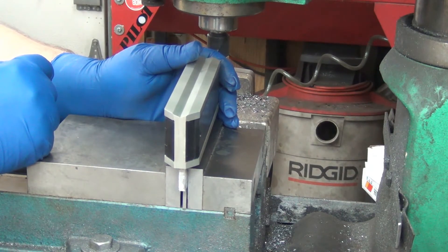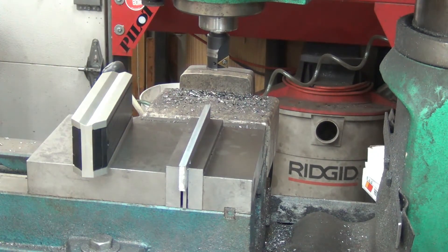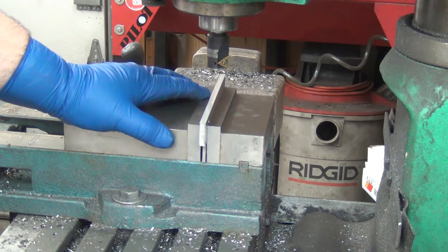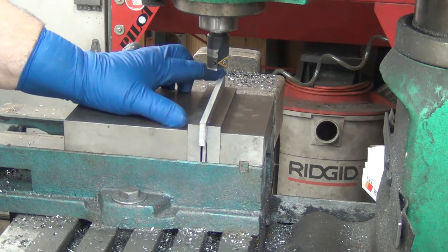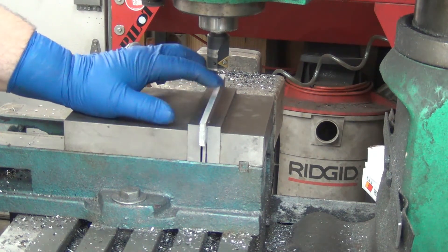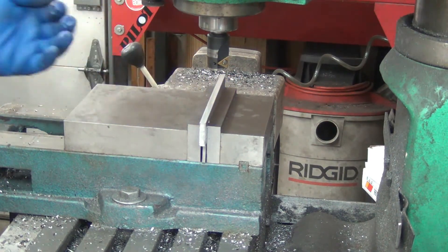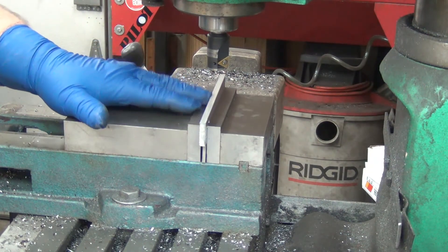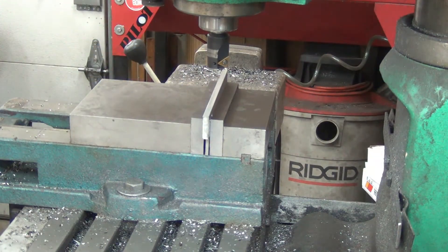3.0! Some of us are blessed — guys like me are just lucky as hell. Now if I was doing this on the CNC, I'd probably put several notches in it, because it would easily run between the two. I don't want to load up three and then have to sit here and turn the cranks. I want to just load up one, turn the crank one way, load up another, turn it the other way. So I'm going to do it fairly close to the middle so that when the vise clamps down on the dowel it should be balanced and won't pitch one way or the other too much.